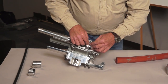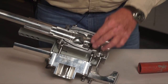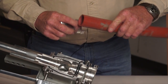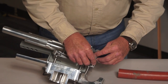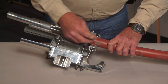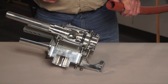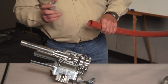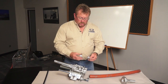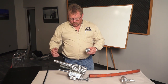We set this seal system down inside — top and bottom — and we have air clamps that will actually grip the outside of the duct and hold it in place. That gives us the full hole inside the inner duct available for whatever size cable so that we don't restrict the air going inside that duct. This clamp can go from inch and a quarter clear up to two inch inner duct, or clear down into your micro fibers.